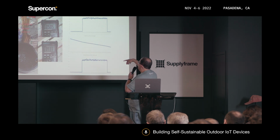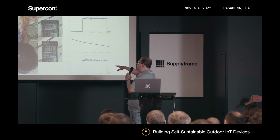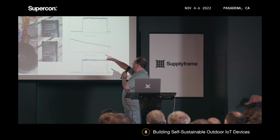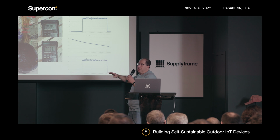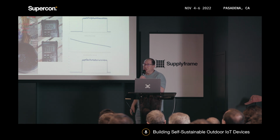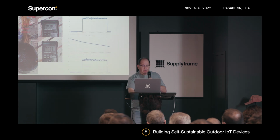And as you can see here in the graphs, you have the current and then the revolutions per second. When the system is running, you obviously get a peak over there that gives you around 78 to 83-ish milliamps of power. However, it wasn't enough. As you can see on the middle one, the battery percentage starts going down as the system is used, and it goes all the way down to 0 and the system is depleted. So it was basically not helping at all with just one.